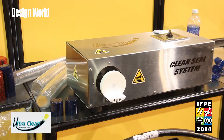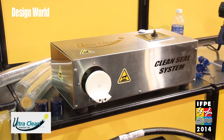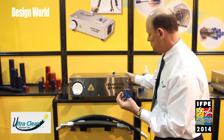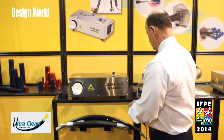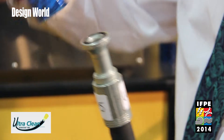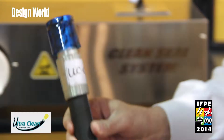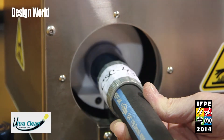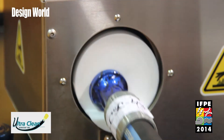We have a machine that is a heat machine that does the shrinking of the capsule. We turn the machine on, we grab the correct size capsule, slide it over the end fitting, and insert it into the machine where the shrinking takes place in less than 2 seconds.